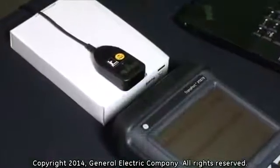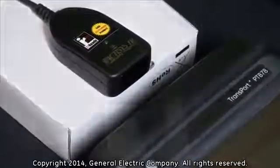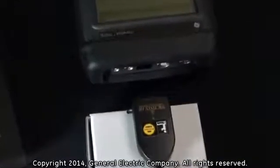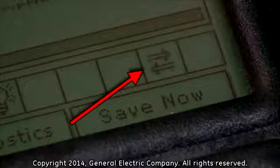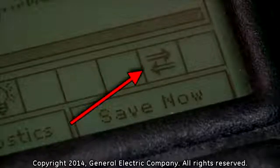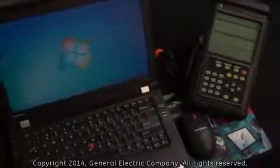To achieve the best wireless signal connection for transferring files, place the PT-878 infrared communications window as close as you can to the infrared window on the USB adapter. Make sure the infrared windows are level with one another and lined up as straight as possible. To confirm that the PT-878 can transfer files and detects the infrared adapter on your computer, you will see an icon of two arrows pointing opposite directions in a small box at the bottom of the display screen. You are now ready to transfer files between your PT-878 and your computer.